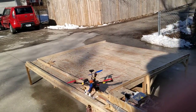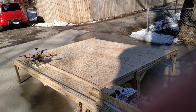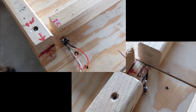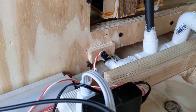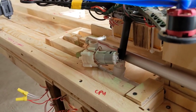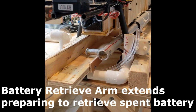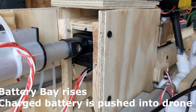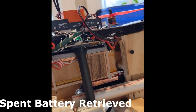Next, AutoIt calls on the Arduino to control the landing pad. Motors under the pad start spinning, moving a trap nut connected to bars on the pad. Those bars push the drone across the landing pad and into the swap station. Contacts at the end of each bar path tell the bars exactly when to stop, giving a nice snug fit — the drone is very much pinched in place. Then linear actuators in the battery swap area make the actual swap: an arm retrieves the spent battery and pushes it into the catcher tray. A battery bay lifts into place and the pusher arm pushes the fresh, charged battery into the drone.